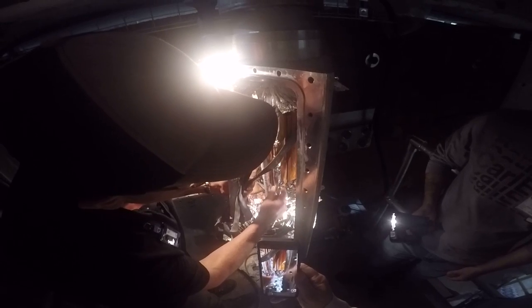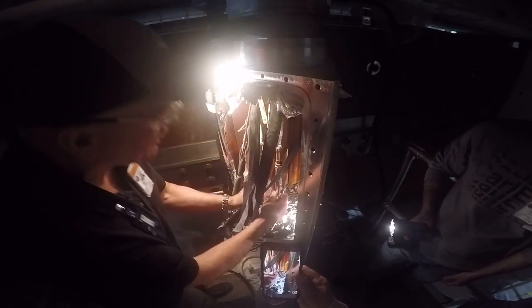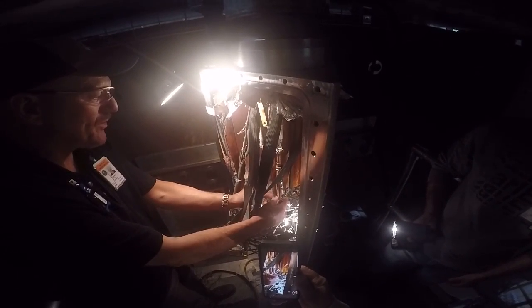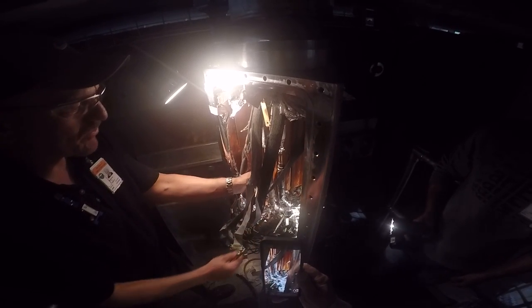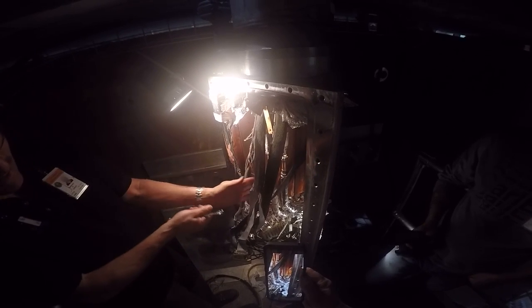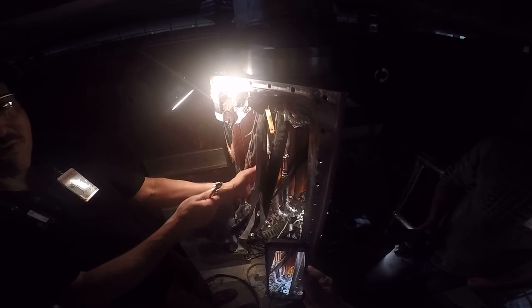Like I say, I bent these, and if I take the insulation down to here, I can cut it probably there, and maybe I can cut this one here. These are maybe two candidate places, and then this one I'll just cut over here, and then you're going to carefully heat shield that and re-sweat couplings on it when it actually goes together.